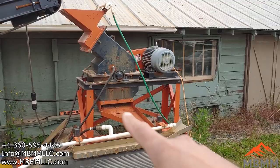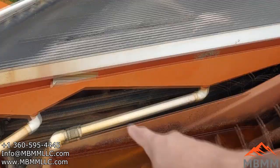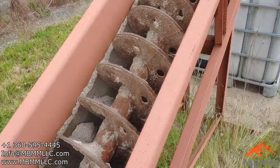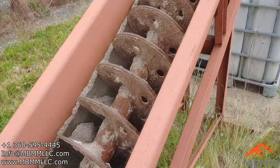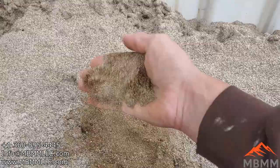Let's go take a look at the turnkey system that we use. I'll walk you through where I got these tailings from and how the system works. Here's the hammer mill — does the crushing. The slurry comes out onto the shaker table, the gold and concentrates come down into the number one, number two, and number three concentrates. Then all the tailings flow down through this pipe into the spiral classifier. This thing turns real slow, and anything that settles down in the basin of water gets augured up the screw and dewatered as it goes. It comes out here into a bag or bin — and this is the stuff we're going to be running today: the dewatered oversized material.